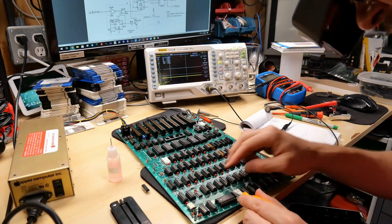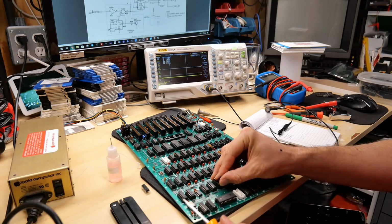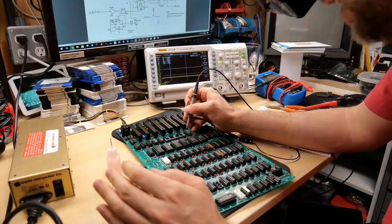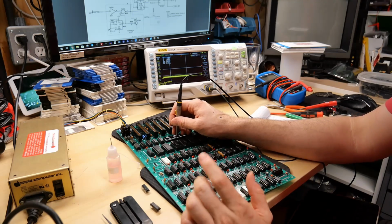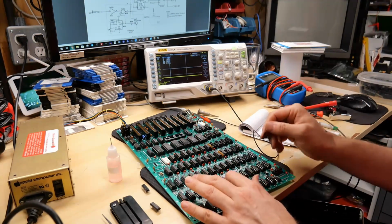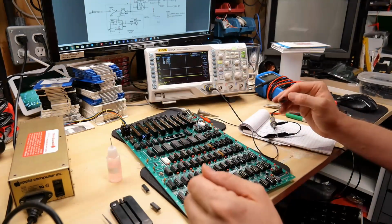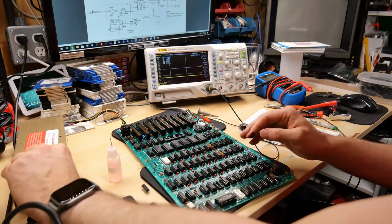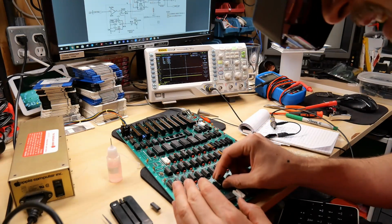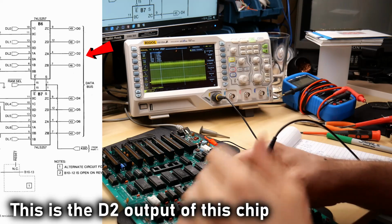But on the other hand, without this chip in here, we don't see that clock signal on the bus either. I'm just going to take it out again and we'll just double check. And nope, we just have low. So something is instructing that chip to send the clock signal onto the bus. Now, I might be going down a dead end, a wrong direction here, because maybe this is completely normal behavior. I'm putting the original chip back in. But looking on B6, when I turn it on, yep, there's that crazy clock signal.